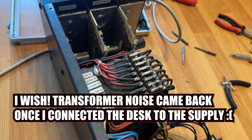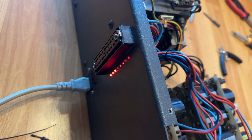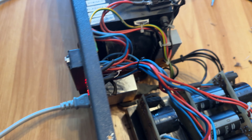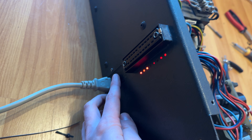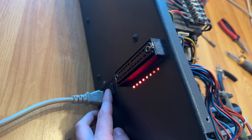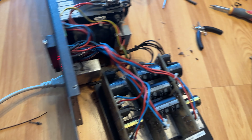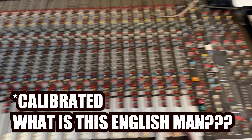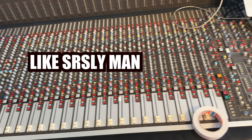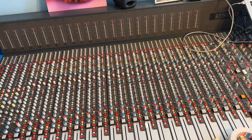And if I turn it on now, it's dead quiet - amazing, super super cool! Another thing I'd like to show you: before I did not have all of the LEDs glowing, and look at it now. I fixed a few contacts that were loose or broken off during transport, and now if I turn on the power supply everything is working, which is super cool and as it should be. I'm very very happy with how it turned out, and I've already calibrated all of these channels - I will calibrate the equalizers in these as well.